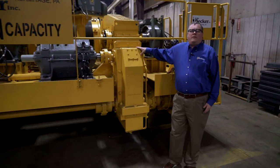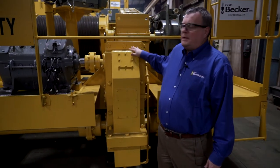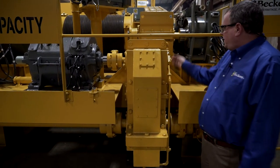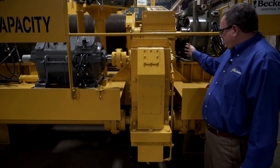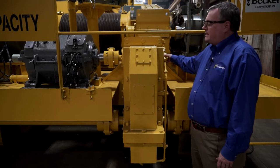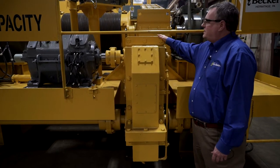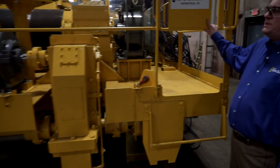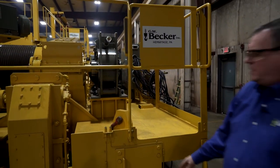Here we are at ground level with the trolley hoist to give you some scale. This is the vertically mounted trolley gearbox. Again, the steel fabrication that's vertically and horizontally split with inspection covers. This is actually a three-stage reducer, so it has a mechanical oil pump here to keep oil flowing to the top. Access self-closing boarding gate with ladder.